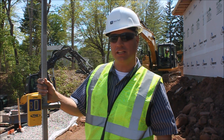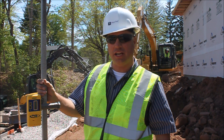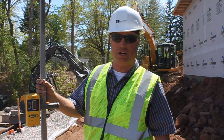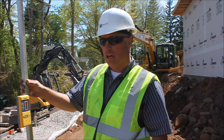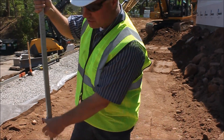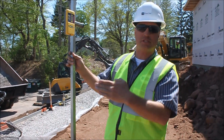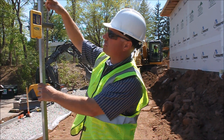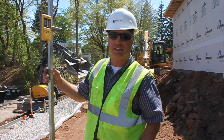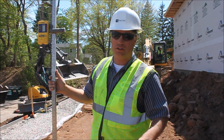For this week's tip of the week, I wanted to talk about wall installations — having your jobs done properly, accurately, and keeping safety in mind. Starting on the base, we had quite a bit of elevation and site work to be done — we had to dig out a couple hundred yards of material. The laser rod came in real handy. Built on the zero-zero system with the internal foot, we're able to easily set our elevation. We had a benchmark on this site, and with our step ups and step downs in our base — our block is eight inches — we're going eight, sixteen, twenty-four for our step ups or step downs.